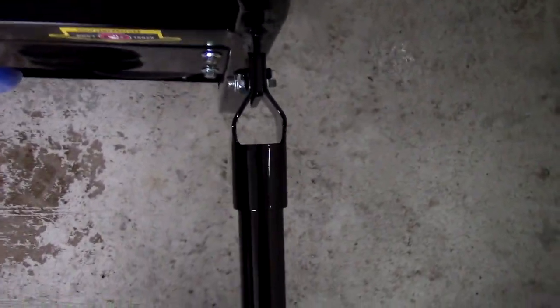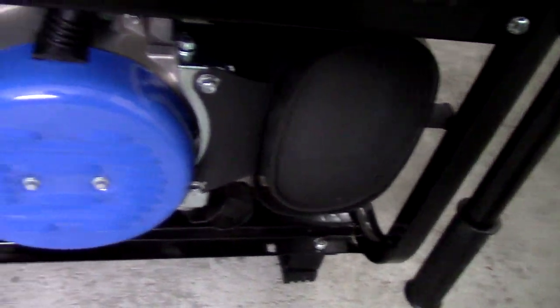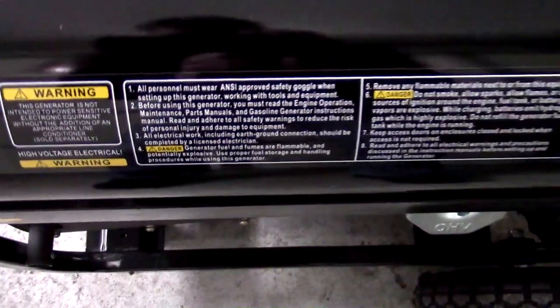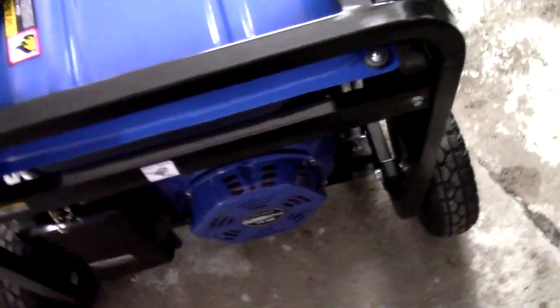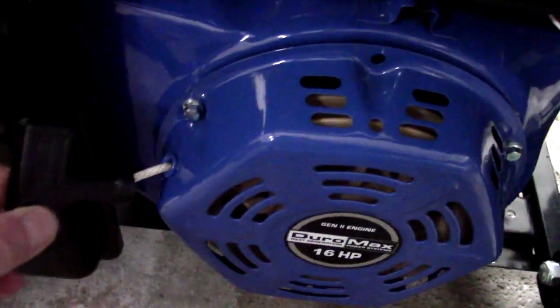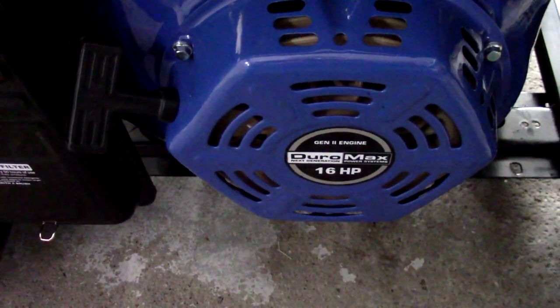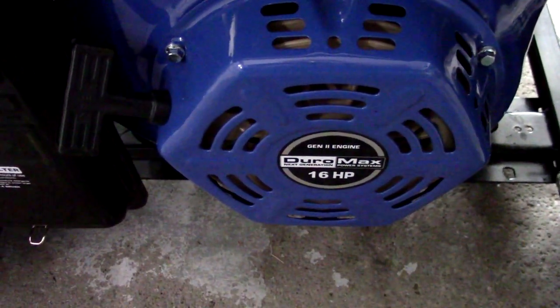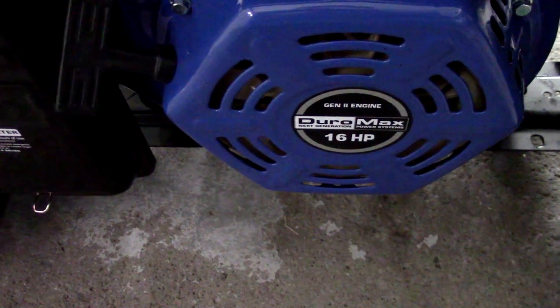Let's take a look at the handles — up and down, pretty simple. Over here to the right is the muffler, and then over here is the crankcase with my wire job. We'll go ahead and take a look at all the warning labels on here — make sure if you do purchase this unit, you read the owner's manual. The pull start is right here and it's pretty easy. You want to start this unit once a month. If you don't start it for a long time, go ahead and drain the fuel because it goes bad. When you go to start it, they do ask that you put a little bit of oil through the spark plug hole.